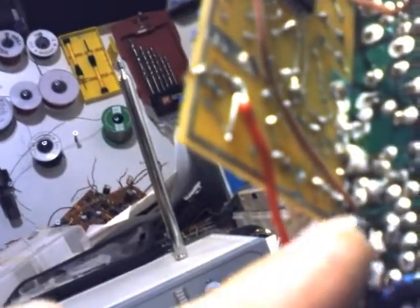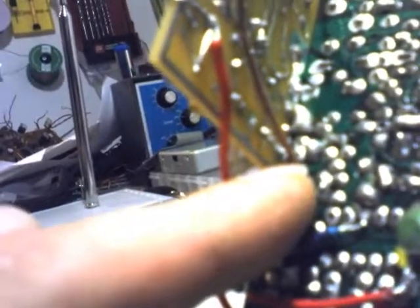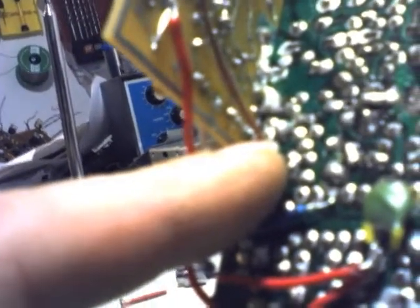I've taken the IF out — it's the output straight after the ceramic filter of the mixer. I've also changed the ceramic filter itself. That blue thing there is actually a ceramic filter, but I've taken the 4kHz audio bandwidth ceramic filter out and put a 10kHz audio bandwidth ceramic filter in. So that's the transformer which feeds the ceramic filter, which then feeds the stereo decoder board.